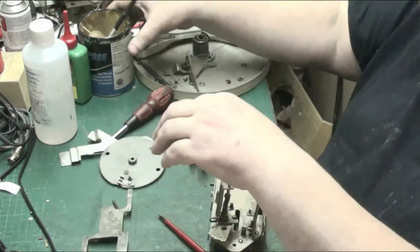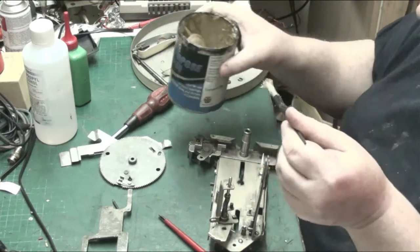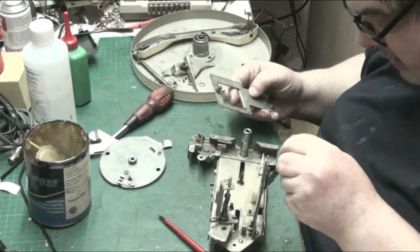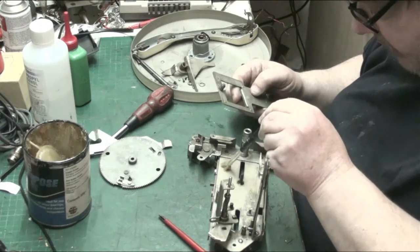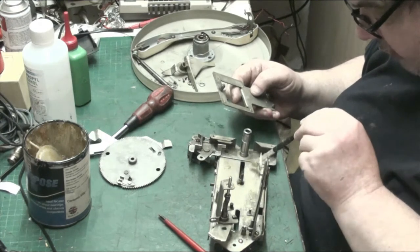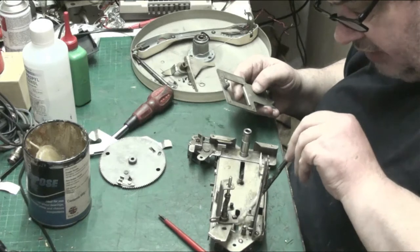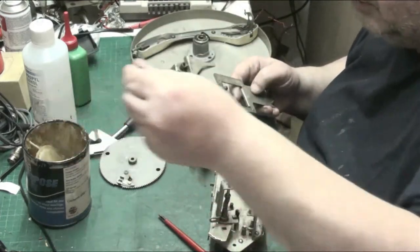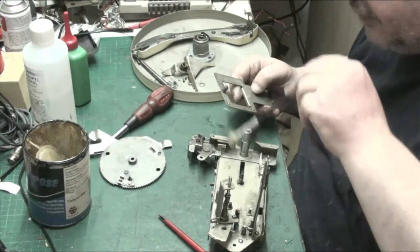Right, so what we need to do is get, so that we don't end up with grease in places where we don't want it. Don't smear it everywhere. You can see where the witness marks are, and that's the only places we want to put grease, where the witness marks are, not all over the damn place. I mean, a bit round there and a bit here, because we're going to be sliding here and there, a bit there, and a bit on this slide here, because that's going to get a bit more grease, we've not got enough grease there. There we go. That's it.